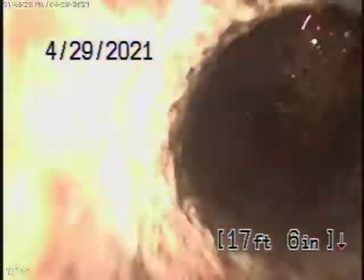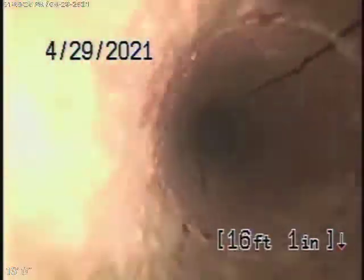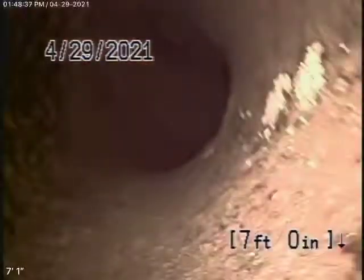In case you have a blockage under the house, there's no way to really clean it out. So it would have been better if it was a two-way clean-out. However, it is a one-way clean-out — you may want to consider making that into a two-way clean-out, which means pulling some of the deck up. The roof vent also has two 90-degree turns in it.